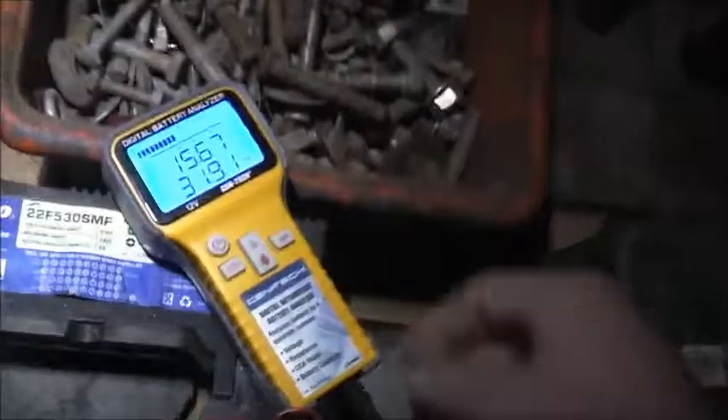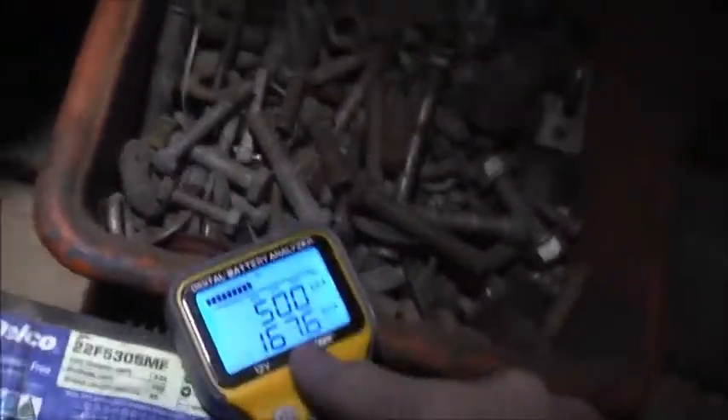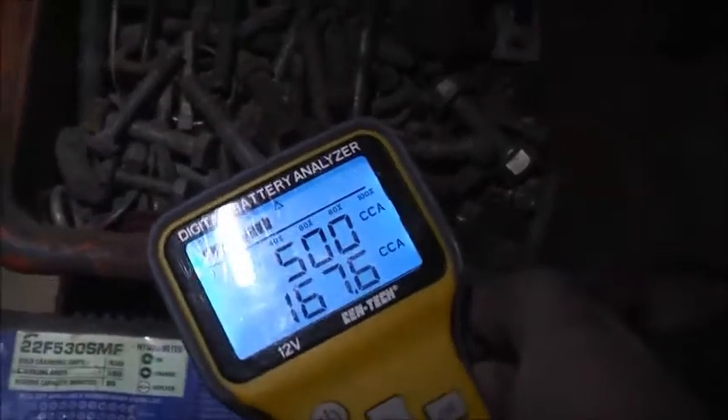That's a lesson to all the other guys starting out in electronics: if you want to buy one of these kits and do what I did, be my guest, but learn about your transformers. Two amps is your limitation — the ideal current you can pull from this transformer. If the battery had been pulling two amps it would have run for hours and been fine. I'll keep my eyes peeled for a similar transformer capable of supplying a lot more current than the two amps this one was rated for.